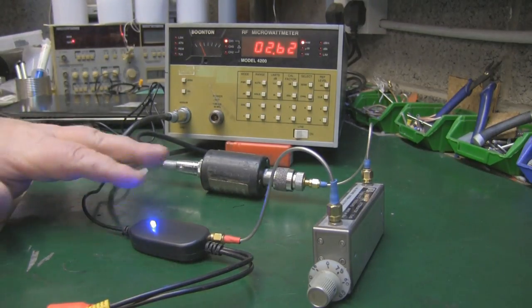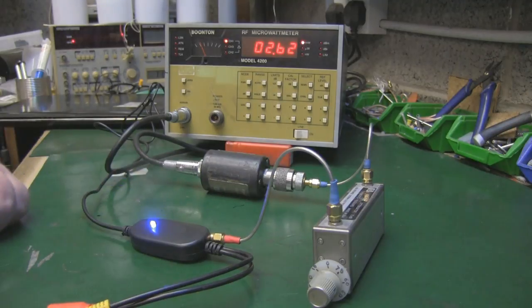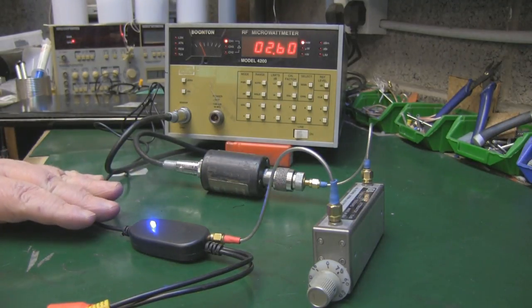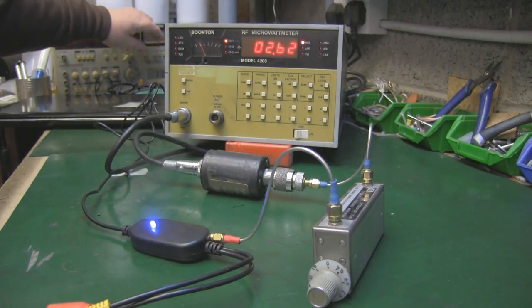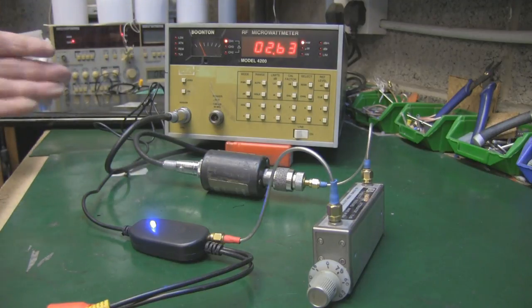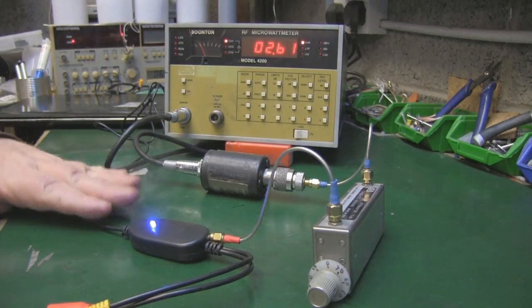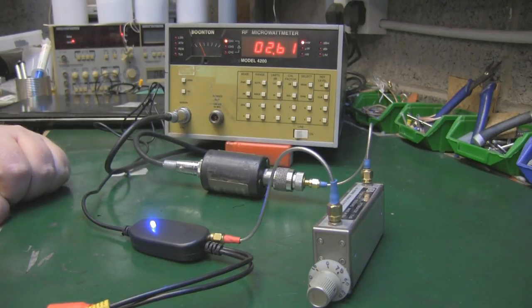It is a cheaper option for that. With the antenna modified there are a lot of possible projects you could use this for. I've got 12 volts running through it at the moment - let's see what it's like with a power drop. Down at 9.5 volts it still seems pretty stable. At 7.5 volts it's starting to lose it, dropping out at just under 6 volts. The power drop as your battery drains down is not too bad - I've seen worse - so it is pretty stable.